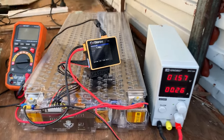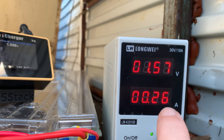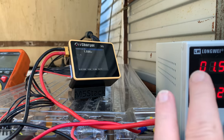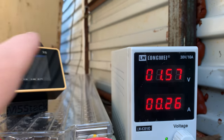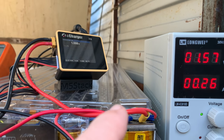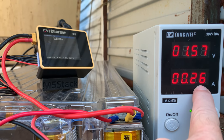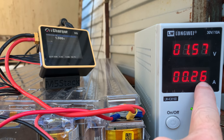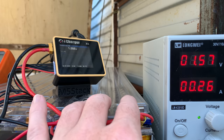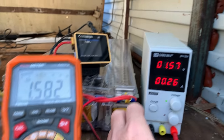Tubers, apologies for the traffic noise — Monday morning. We've got 1.57 volts and 0.26 amps. At night time we're going down lower in amps and then during the day it went back up to 0.44 amps — I'm assuming that's got something to do with either the heat of this device, its inaccuracy, or temperature-related resistance changes within the batteries. At 48 hours at roughly 0.45 amps we would be putting in about 20 amp-hours into this battery over the last two days. At 20 amp-hours that should be a reasonable result to see if this battery is going to hold a charge. No use going on for weeks — so let's turn this off. We'll grab the multimeter first, turn that on, and we'll turn the charger off.